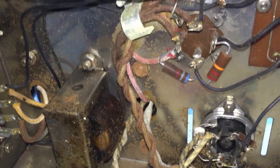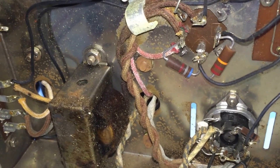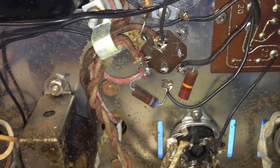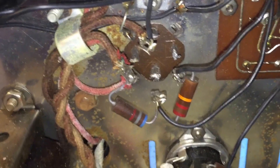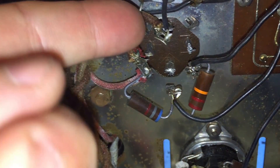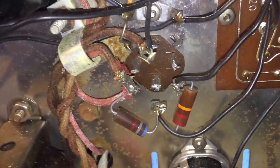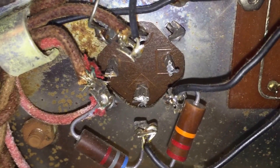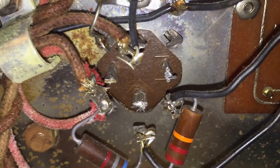The resistance on the RF choke came out pretty good, but the inductance reading was a little low for my liking, and it was suggested I measure it out of circuit. To preserve the connections so I don't have to go back to the schematic, I snipped these connections from the capacitor at their lugs — all four of them — as well as the ground going to the star ground. Then it's just a matter of turning the tabs and pulling it out. When I put the new capacitor in I can observe the orientation and solder connections on one by one.